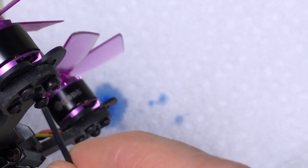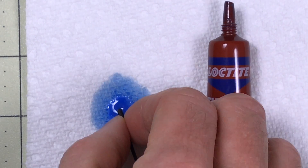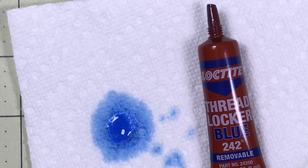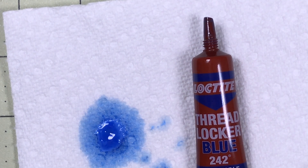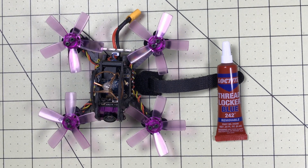These were not even close to going to stay in place. Also another thing about Loctite that's confusing - the blue Loctite comes in a red bottle. I don't know why. Comment down below if you know why - maybe somebody works for Loctite. But anyway, for doing this you want to make sure you have blue Loctite. Do not buy red Loctite, which makes it confusing because the package is red. The package should be blue, but it says blue right here - 242. Red Loctite is permanent, so if you use red Loctite don't ever plan on getting the screws out. With as little as I use here it's probably still possible, but man, would it be a whole lot harder and you don't need it. Just get the blue Loctite and you'll be fine. The bottle says it sets in 20 minutes and cures fully in 24 hours. I'm probably going to give it about 12 hours - it's going to be tomorrow morning before I have a chance to try it.